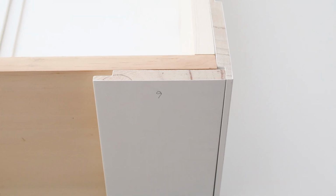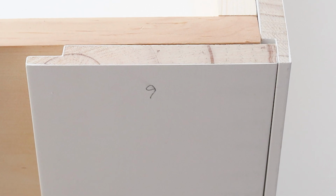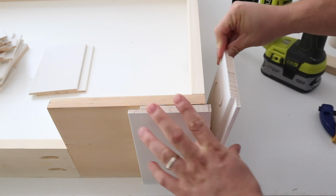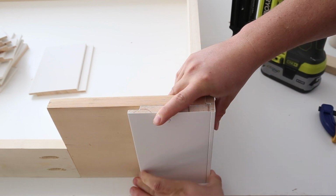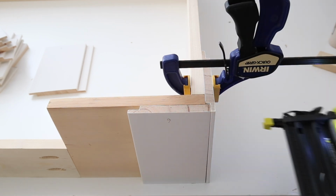Begin on the front right corner of the frame and line up your first 7 1/4 inch shiplap board on the side so that the short overhang is extended past the front corner of the frame. Then place the custom cut shiplap board with no long edge next to it as shown here to form the front right corner. We attached the side corner board first. Attach both boards into place with wood glue and 1-inch brad nails.